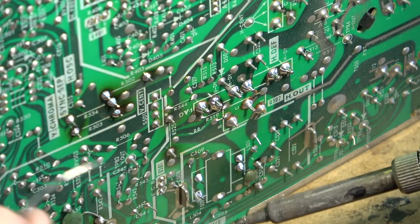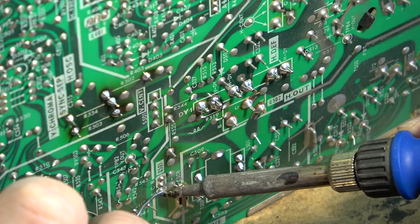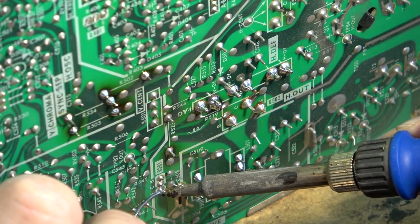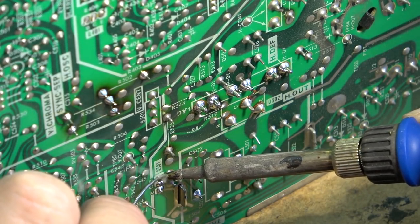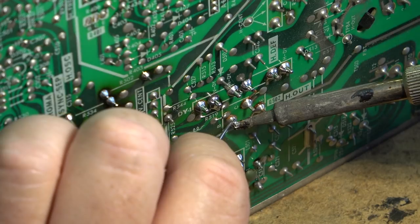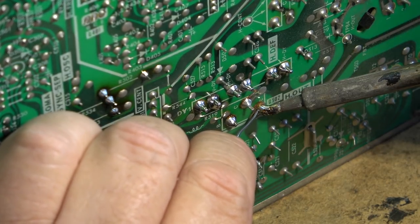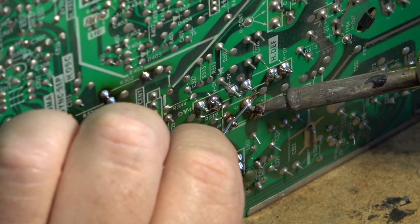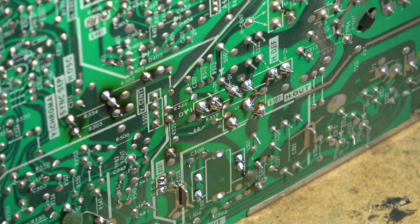Blow the transistor. So whenever you see a Sony, especially a Sony, it's always a good idea to resolder the horizontal output or horizontal drive transformer and the horizontal drive transistor and even the horizontal output transistor. It's a good idea to do this just proactively, because this is a very common mode of failure, and when it does fail, it's always going to blow the output transistor. And these output transistors, they were expensive 30 years ago.